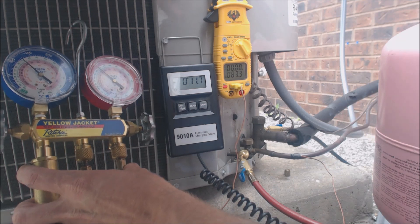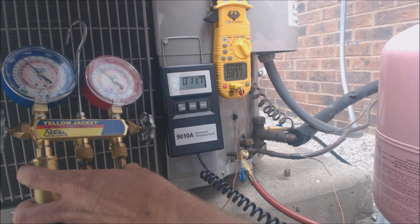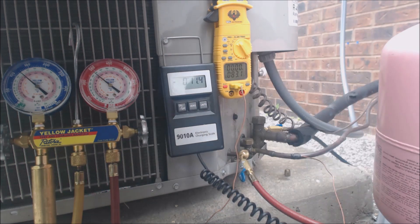We're at about 93 degrees saturated state and we're at 83 degrees here, so that's 10 degrees of subcooling. It's good to have anywhere from 7 to 13 degrees of subcooling — so plus or minus 3 degrees will be within the rating we're calling for on this unit. That's how you do it. We'll see you next time at AC Service Tech Channel.